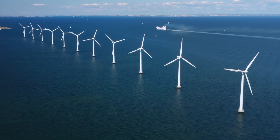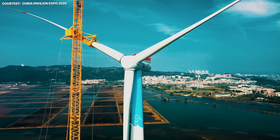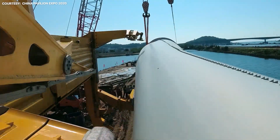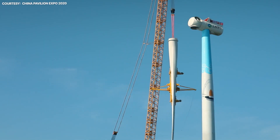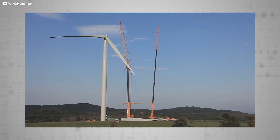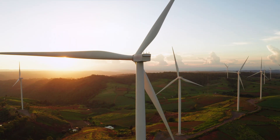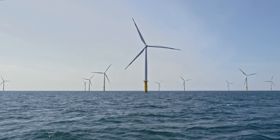Winching up a 100-metre-long, 55-tonne fibreglass blade — literally designed to catch the wind 150 metres in the air at sea — is not easy. Each blade root is encircled by guide pins that marry up with flange holes in the hub. Engineers have developed two new techniques to compensate for the wobbly tower and motion-prone blade, both of which sound a bit like cheesy anime villains. Blade Dragon is a lifting yoke that holds the blade more firmly and can be affixed at an assortment of inclined angles. Boomlock eliminates lateral movement on the crane hook so the blade stays steadier. These techniques work at relatively high ambient wind speeds using fewer operators, getting the installation done quicker and cheaper.